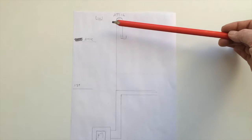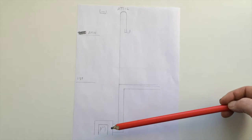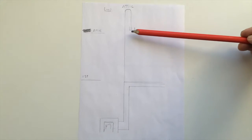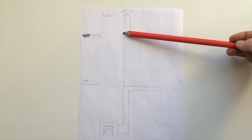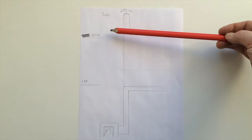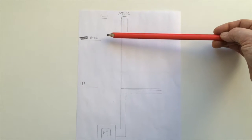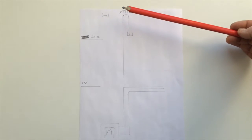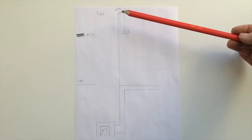And so after there's about 5 gallons of water in this. So once it has flushed 5 gallons of water, obviously this water line is going to come down. And once it hits the level of this tank, the siphon effect will, well, basically the pressure in here and here will equalize. There'll be no longer a vacuum and it's going to stop. Then the water is going to build. This tank is going to start filling itself back up again, just like your toilet. And the level will reset itself again. And it's effectively, for want of a better word, rearmed to repeat the cycle infinitely.